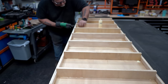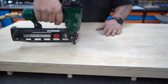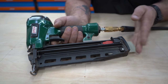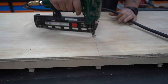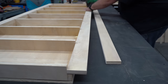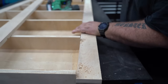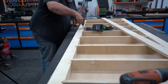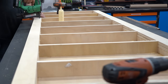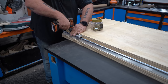As the name implies — slab flattener — you want to keep your base as flat as possible so that when you're flattening slabs, everything comes out flat. My workbench is not flat; there's a big arch in the middle from weighing down over time. What I did was shim up the center so it was really close to flat, and I built this whole thing in layers so each layer can fix anything that's not perfectly flat from the layer before. The legs and bracing that come in add to an effect that effectively makes it a torsion box without really building a torsion box.